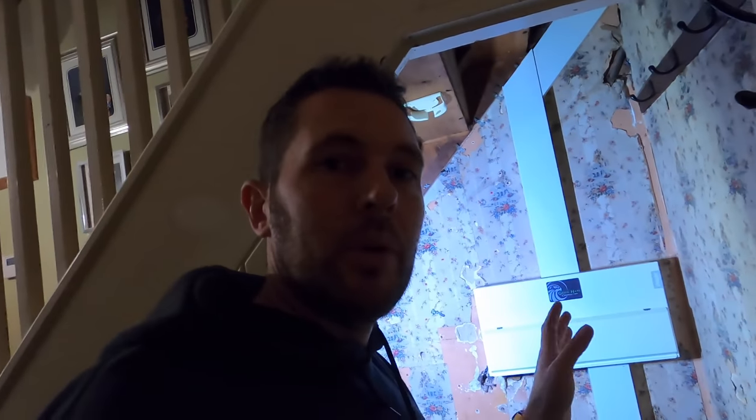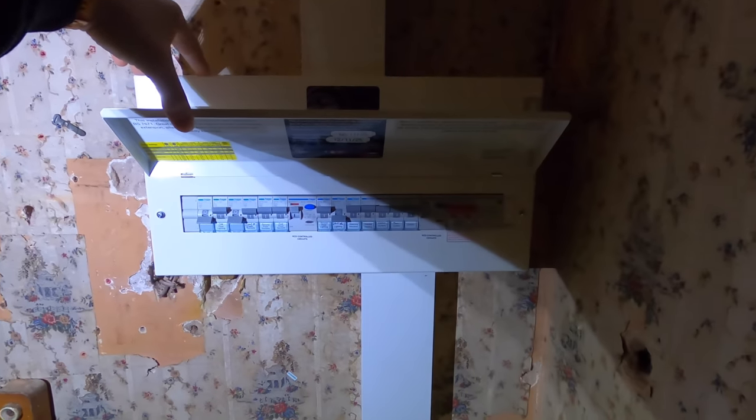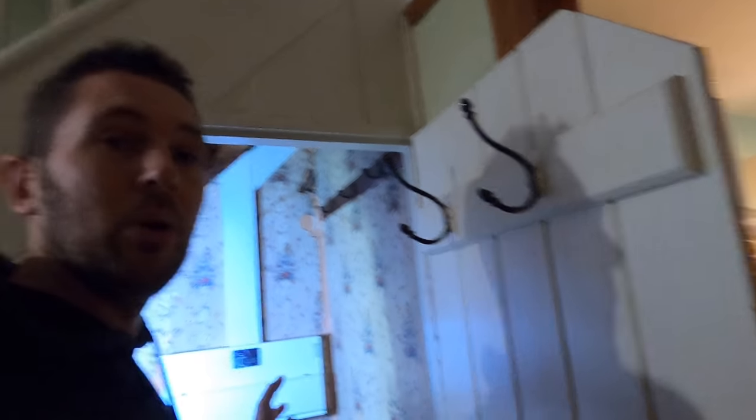So that's what happened. A lot of people have asked why we're not putting an RCBO board in - what we've fitted is a dual RCD board with SPD. It comes down to costing and also getting hold of them, because for an RCBO board I generally use Fuse Box and I normally get them from Consumer Unit World, but we've just been struggling to get hold of them. We were actually going to upgrade them free of charge to an RCBO board with Fuse Box but we couldn't get one. So we've gone for a Hager - I feel it's a premium brand and for a split load board, Hager's all the way for me.